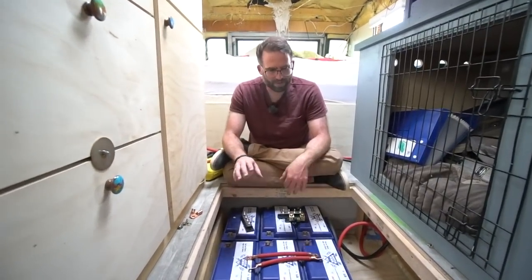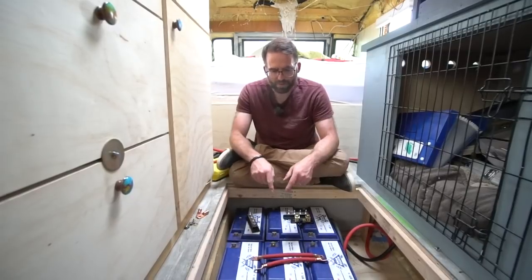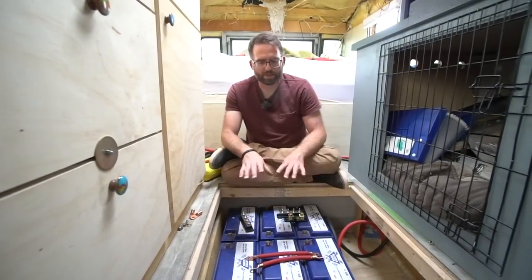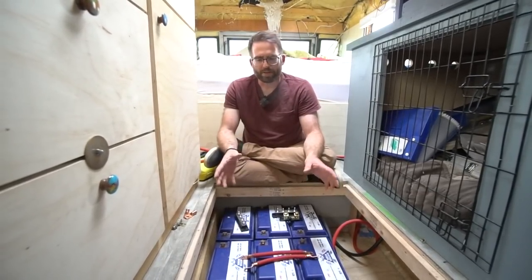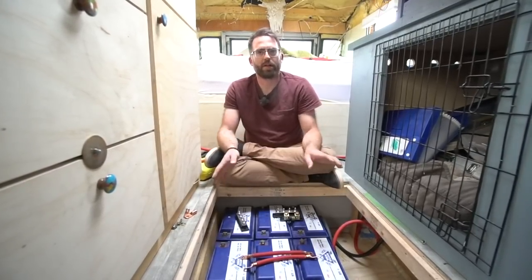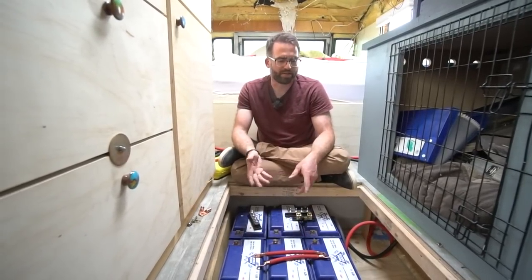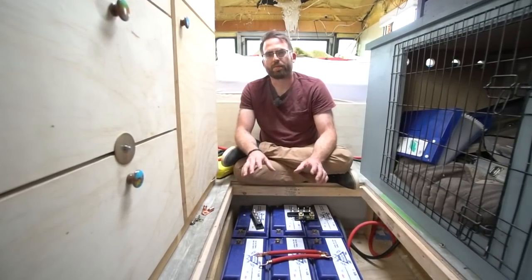In this case the task was to figure out the orientation of the batteries, and that orientation is actually dictated by how we want to draw the power off of them. So like we were talking about with parallel or series, it really helps to try to shuffle the batteries around — it's like one of those little puzzles with the numbers, you've got to get them in the right order. The most optimal arrangement depends on the geometry you're trying to fit the battery bank into, and the chemistry of the battery — whether it's lithium or lead-acid — dictates the most optimal way to put these together.